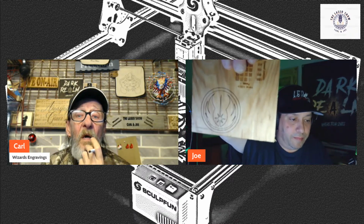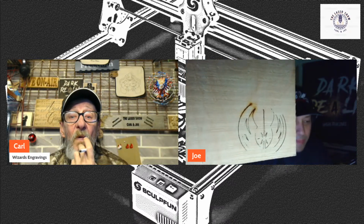Oh, that didn't cut through as good as I thought it was going to. Yeah, I was kind of screwing around, but it didn't go all the way through. No, it didn't. What power were you using? Oh, where did I have it at? Oh, 80%. What speed? 400. Okay. Yeah, you should have bumped it up when you're down like that. Bump it up to 100%. But you're going to find that on different wood.